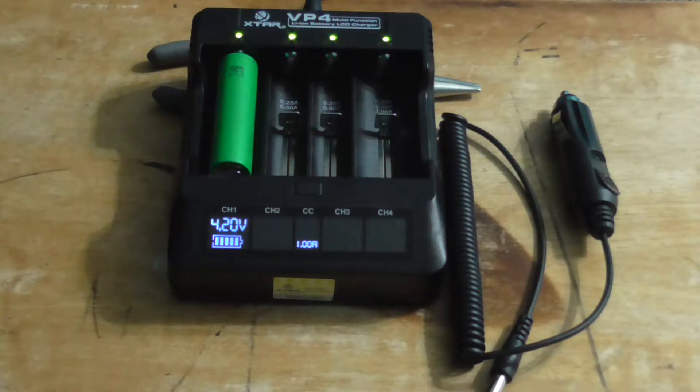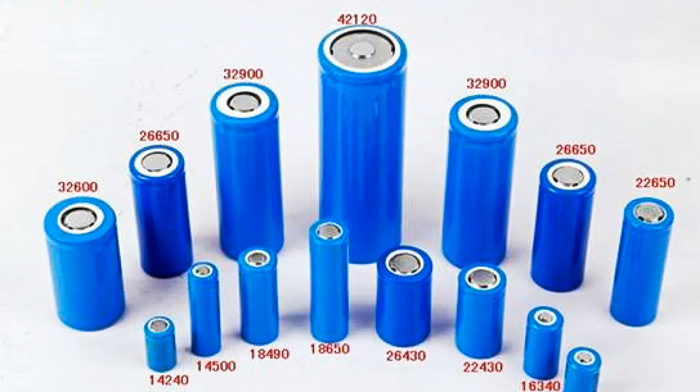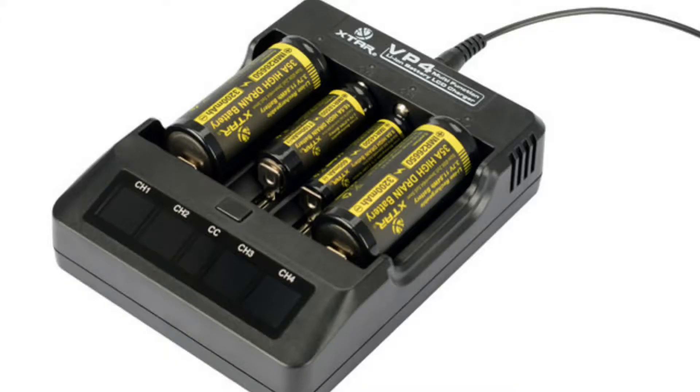So what are some of the key aspects of this charger? For one, it's compatible with a lot of batteries. It's also compatible with IMR lithium batteries. If you're not familiar with what an IMR lithium battery is, basically it's a high-drain lithium battery — they typically have high C ratings, so they can dump a lot more current in a given amount of time than a standard protected lithium-ion battery can.